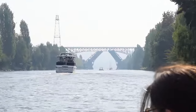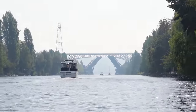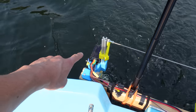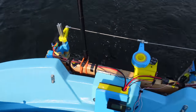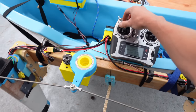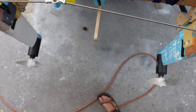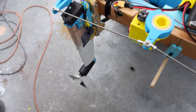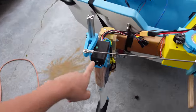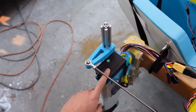Oh, the bridge is up again. Look at that. Amazing. Even while cruising at only like 300 watts, that thing was still getting pretty hot. So maybe that's why that one broke. Not sure. Little update, now suddenly, both motors are working again. I just let it kind of sit there for a few hours and now they work. So maybe it was in some sort of a thermal foldback mode where it had overheated.